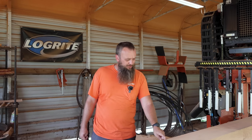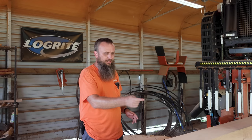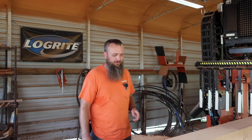The pith is in this timber right here. So I'm going to flip it up 45 degrees and saw off of this face. And once I get down close to the pith, this one will be finished. I'll discard the pith for firewood. I've got one more cant over here to work on, and that one should be pretty nice. I didn't see any large defects in that one. It might turn out pretty good.